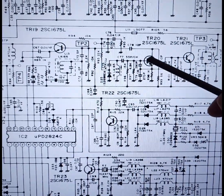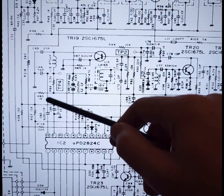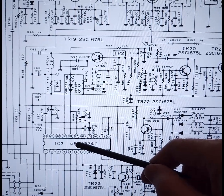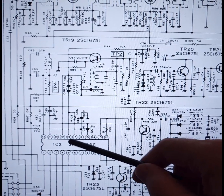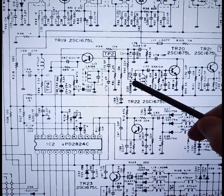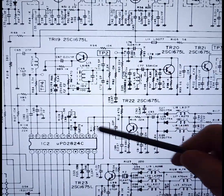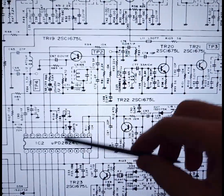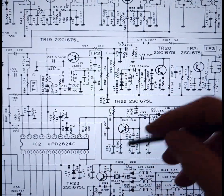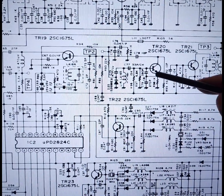The 16 megahertz VCO mixes with the 15, gets filtered here and picks off the 1 megahertz signal or thereabouts, which then normally gets controlled by the PLL, and then that DC control line comes back and changes or locks the frequency of the VCO at 16 megahertz with that 1 megahertz signal. So what I do when you replace that, the new PLL will easily manage up to 60 megahertz or so. So I just changed this circuit here. This is the 16 meg.